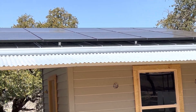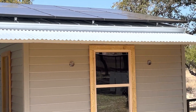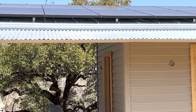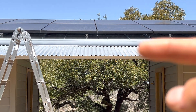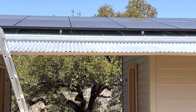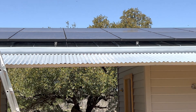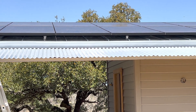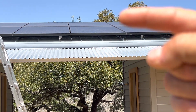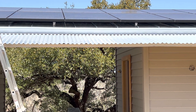There it is — we've got it centered on the roof, slightly overhanging the step up. That way you keep that vertical step-up piece of metal from being in the sun, which would draw your eye to it. We shifted the panels down enough so that it's thrown in the shade most of the year.